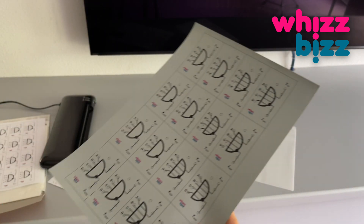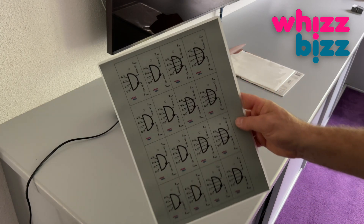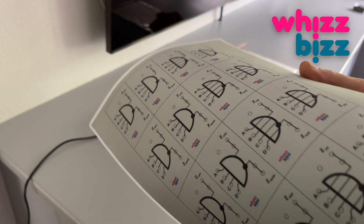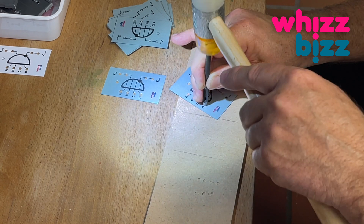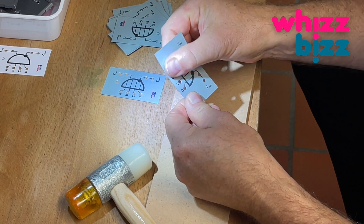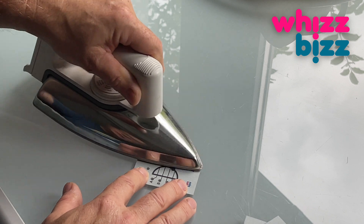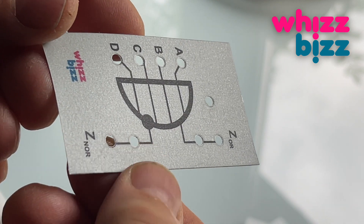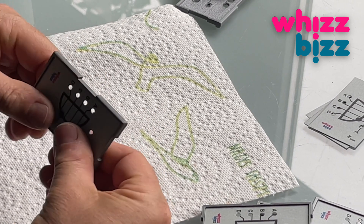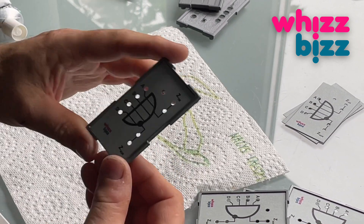Some time ago I found this really nice aluminum-look paper. With this lid, I can compile 16 of these small faceplates on one sheet. The next step is to hot-laminate the sheet with a matte lamination cover. This protects the faceplates from water and dirt and makes them thicker and sturdier. Then comes some old-fashioned handwork: cutting the individual faceplates loose, punching holes with a punch pipe, and cutting any square openings. Because the holes sometimes form a raised edge, and to reinforce adhesion around the edges, I often run the fronts over with a not-too-hot iron. This re-sticks the laminate foil around the holes and dissolves any air bubbles. The final faceplate already looks very good. So that's how I make the faceplates that I glue into the recessed area of the lid.